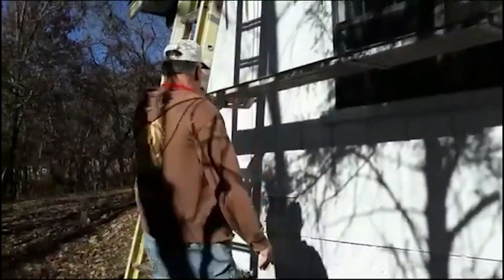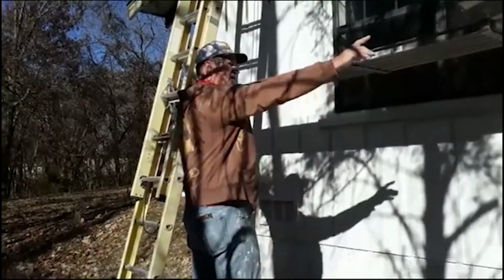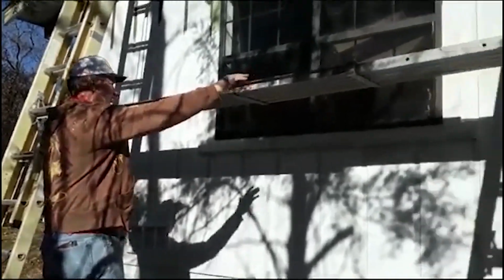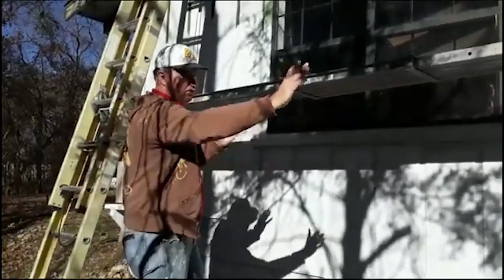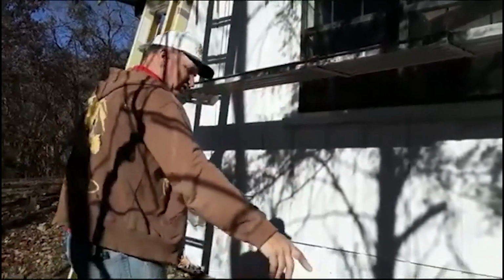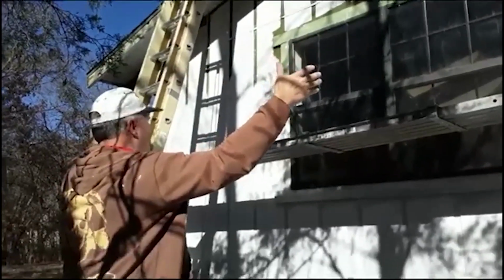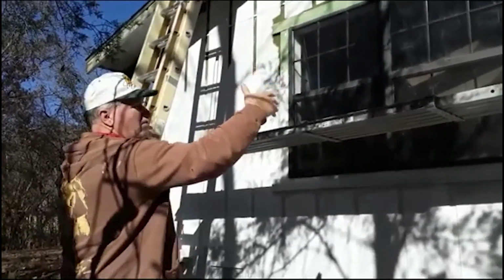So when the ladder jack is maybe a little bit lower this way and higher over here, and it runs this way, it kind of goes the opposite of what it wants to go with that. But you still need to make sure everything is steady on the bottom of your ladders and your ladders are fairly straight up and down. And pay attention to your weight load.